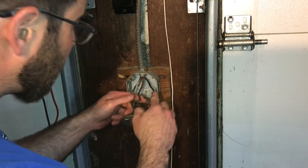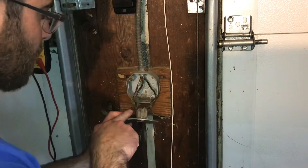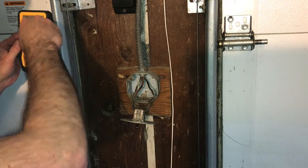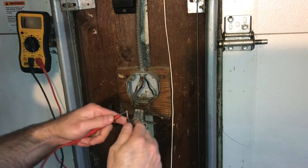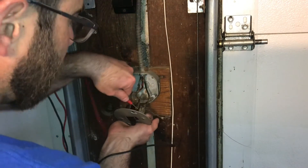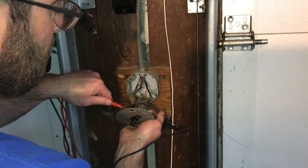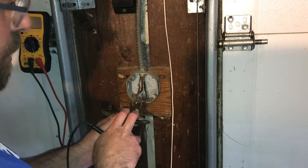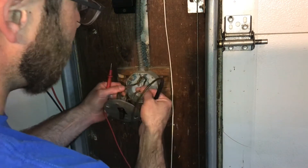This is some old wiring - I have a black, a red, and a white. I think both the red and white are travelers and the black is power. Here's how I'll test that: I'll switch this to continuity and I should hear a sound when I connect. I'm going to check across the switch. Right now I have a connection on one and not the other. When I flip the switch, I now have a connection there and not there. So that means this is my power and these two are my travelers - it's just toggling from power back and forth to the red and white travelers.